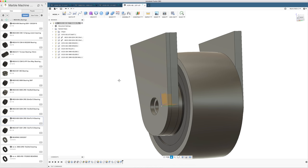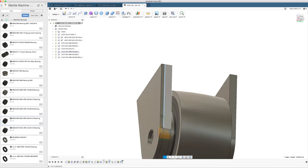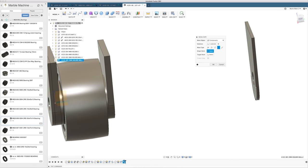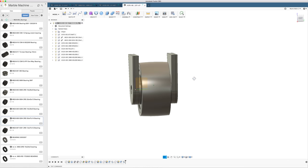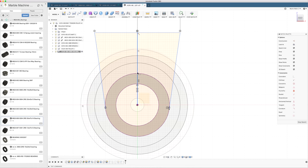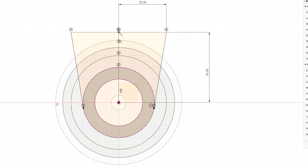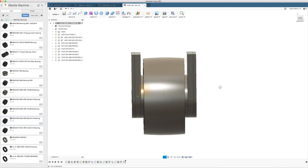So when I get these parts, I can just put them together and I can weld this line here without using any filler. And those welds always look great because they're so easy. Put the point-to-point command, boom, boom. I love that. So if I think there's a little bit too much air here, I can go back to the first sketch and I can constrain this line. I can hit 30. Everything follows. I click stop sketch, all the parts are following. So you see, even these parts and these parts are linked.